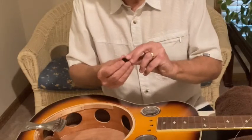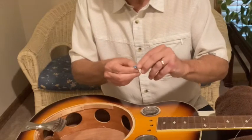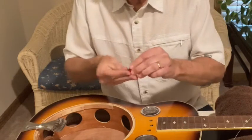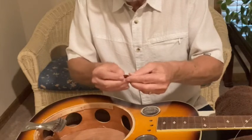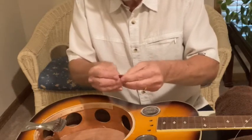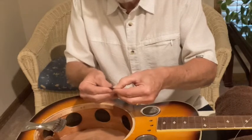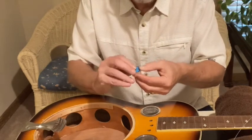First thing to do is take the magnet and a little bit of this blue putty — and I do mean a little bit. They say the size of a piece of rice; I use one about an eighth of an inch in diameter, maybe not even quite that much. Very carefully put it in the middle and then just squish it out toward the edges so that it covers it as flat and as evenly as you can get it. As you can see it's not perfectly smooth around the edges but it covers the whole surface pretty well and it's pretty even thickness.